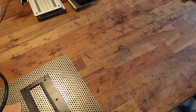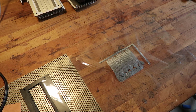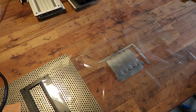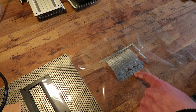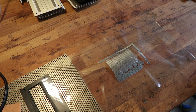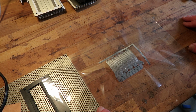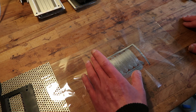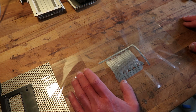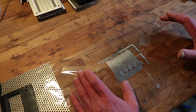Another thing is, if I want to make multiple of these, I want it to be able to be plotted. And the reason is, it's easy, it's clean, there's no acid, there's no nothing. So I want a plotted membrane if possible. The only downside is the only sticky aluminium I can find is 30 micron. I wish I had something like 15 micron. That would be really awesome. If you know where to find it or something, please let me know. Or if maybe someone can make it, I don't know. But 30 is workable, but I rather have thinner as well, so I could do much more.